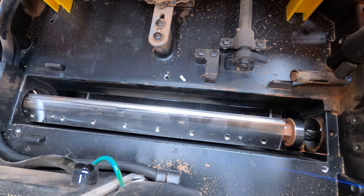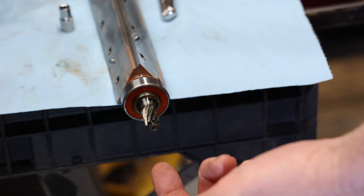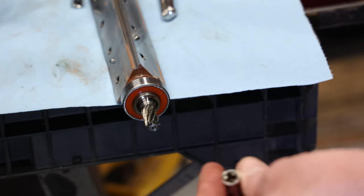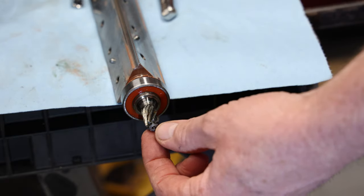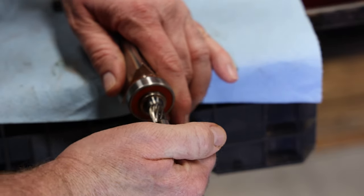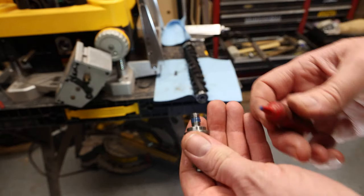Slide the shaft through and remove the gear. You'd think the steel would be harder than a brass drift — that's what these are meant for — but this is no longer a 6mm hole like the manual says. It looks like it may have mushroomed a bit, so maybe use a chunk of hard maple instead. It now fits a quarter-inch socket — use a six-point so it doesn't round off. Blue Loctite — a little dab will do.